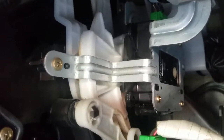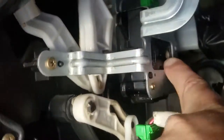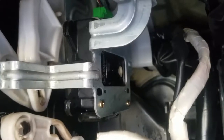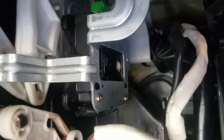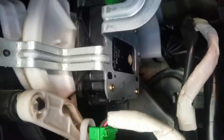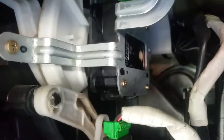It's getting better as the lube works in between the contact plates. All I did was drill a tiny hole right next to that shaft with a small bit, and shot the DeoxIT in there, which makes its way to the fingers and the contacts, then ran it through the cycles probably 30 times. Then came back with some fader lube and I'm running it through now for about the fourth, fifth, sixth time. It was working nicely — no longer does that. Here is the mode where it typically holds up, and it moved right to it — no jitter. Nice.